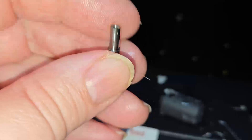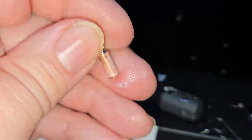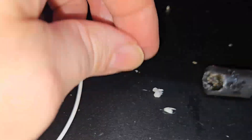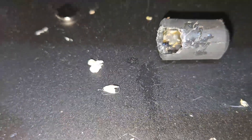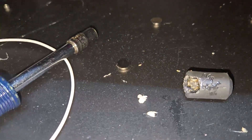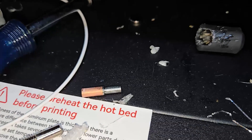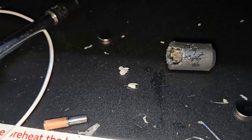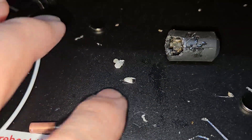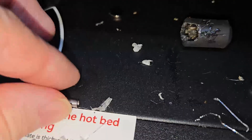This part was still stuck in there and would not come out. I pushed and pushed from above. I took the heat sink out and the hot end out and tried to push this out, and it just would not go. Because there were fragments of ceramic from the heat break in that space where the hole is, and it could not get past them. So I had to push that little piece back up from below and meticulously push and scrape and pull and everything, which was every bit as insane as it sounds, until I got first this piece out and then finally this piece of ceramic out.